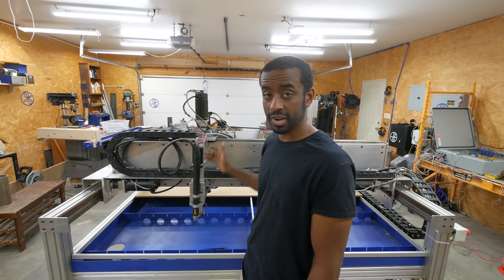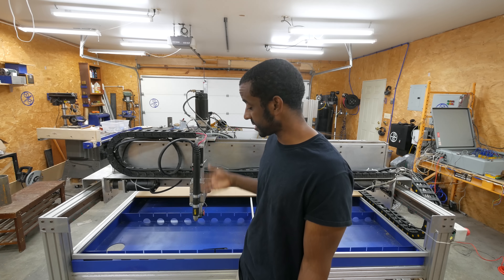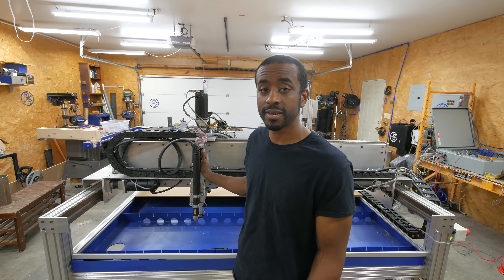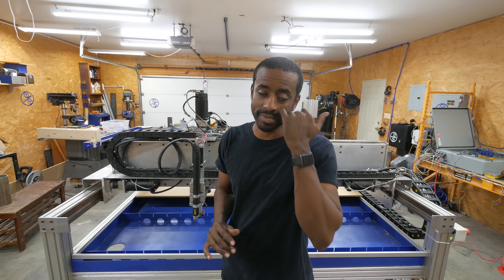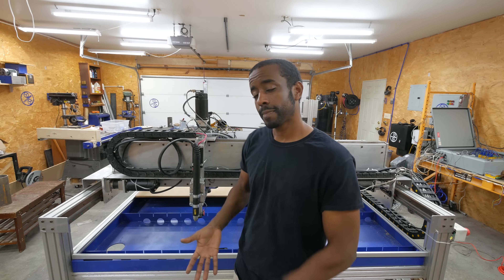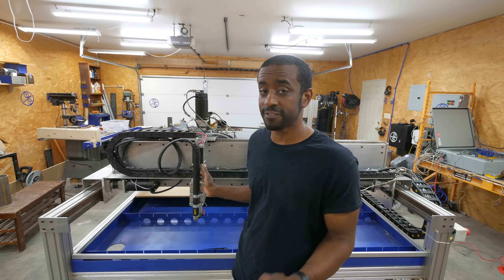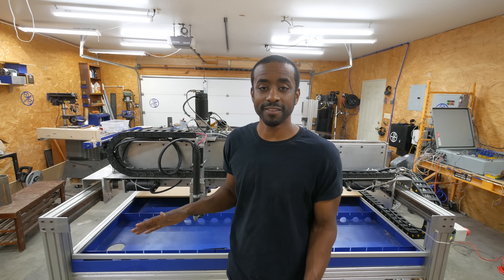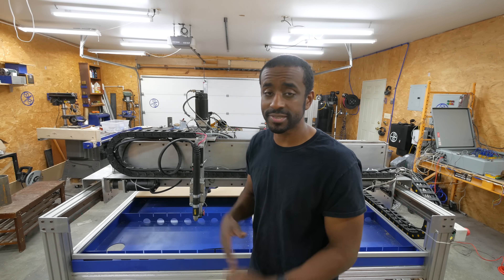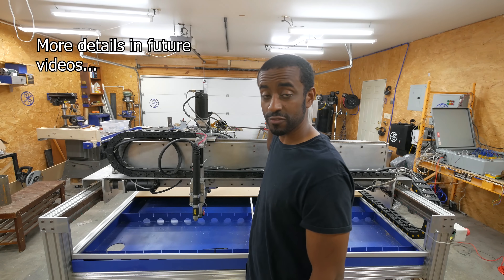Here we have a stepper motor driving my plasma cutter head. The reason I chose a stepper motor here is because I don't need a lot of speed or power — this head is really lightweight. If you're moving slow and don't need much power, a stepper motor is by far the most cost-effective option and it's plenty accurate. People in the comments say you need an encoder or a servo motor so you don't lose steps, but if you're not overpowering the motor you won't lose any steps. For applications where the thing you're moving is lightweight and you're not moving it fast, use a stepper motor. But in situations with long travel, high speed, and high accuracy, you'd use something like this brushed DC motor with an encoder attached, talking to my servo driver.